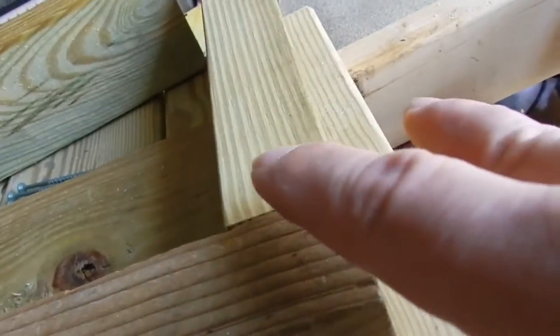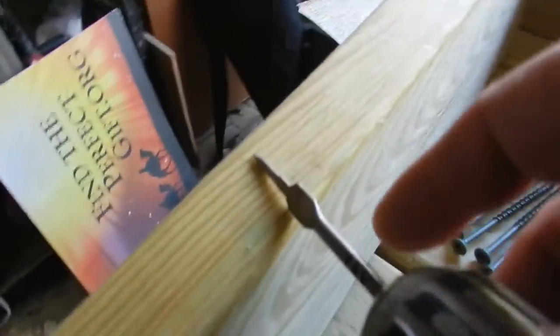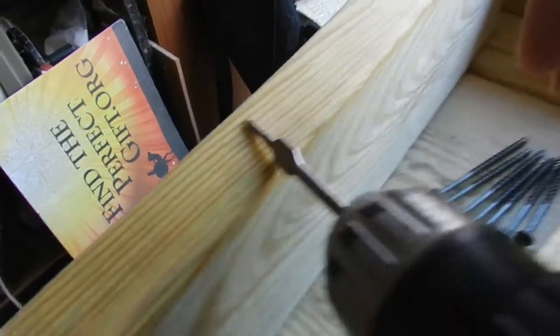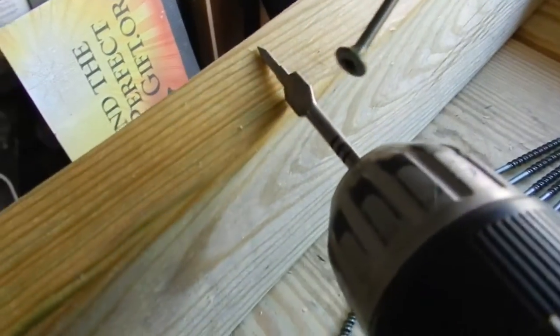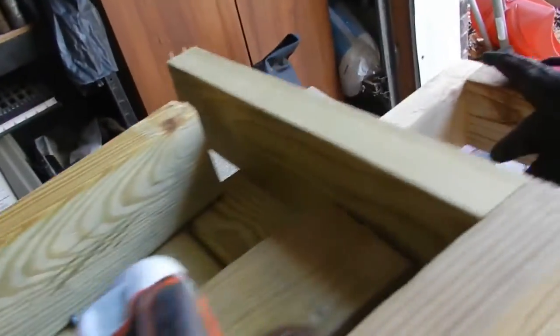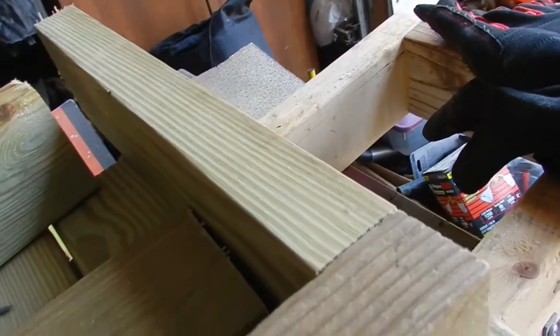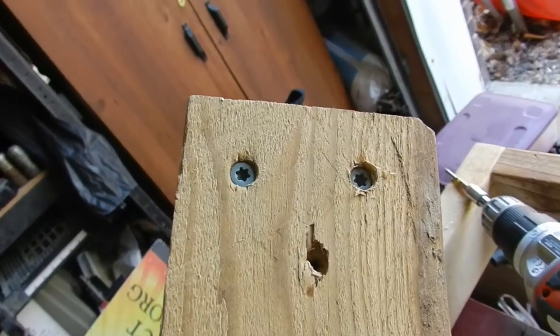And you want to make sure they're absolutely flat, and then I'm using a preset, okay, that actually measures up to this. So it pre-drills, and I put two right there, and then I'm going to go ahead and put these together and work my way around. Make sure they're truly 90 degrees, as flat as possible. And just keep going. Now see, that's what I like right there.